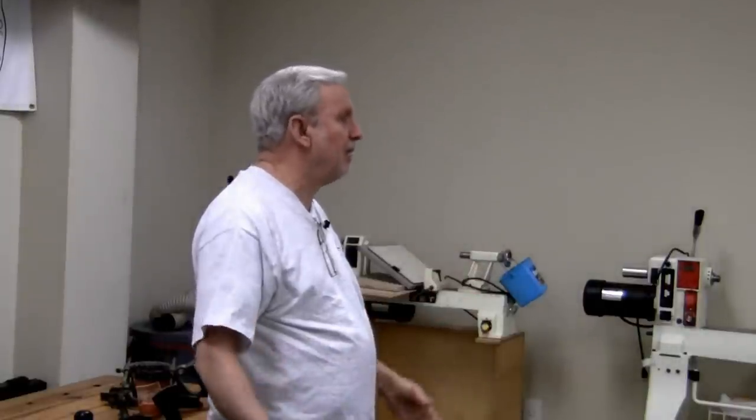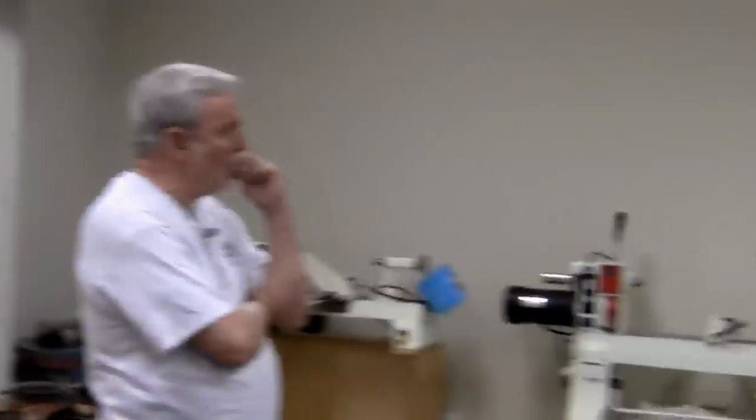How many of you have done that? Yeah. How many were successful at it? You were? Well, that's unusual. Go ahead. If I'm trying to do decent joints, I joint them on the jointer. Right. The power jointer. Right. I'm running an old Newman. And then I will dress them. But that 8 is just too much weight. I use a number 7 with a fence on it.